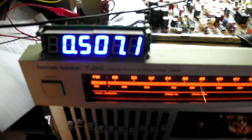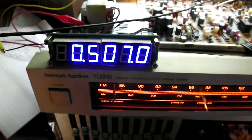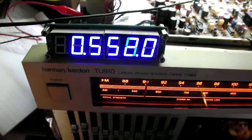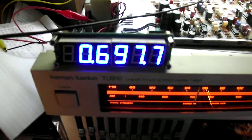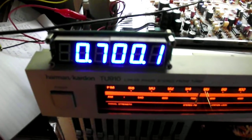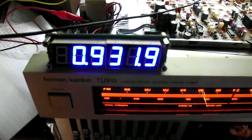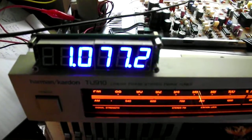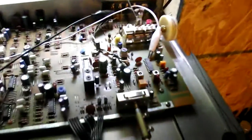As typical of many analog tuners, your ranges are a little bit different. Quite simply, it's reading the local oscillator output. So as I move the dial, you can see the change in the oscillator frequency being adjusted, and we get the true readout. So that would be AM 700, this would be AM 930 — getting a digital readout on a strictly pure analog tuner.